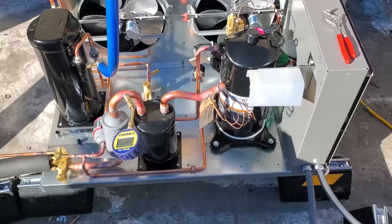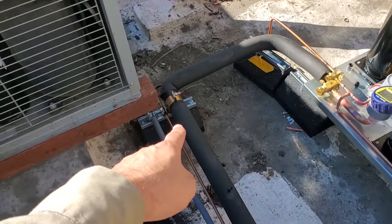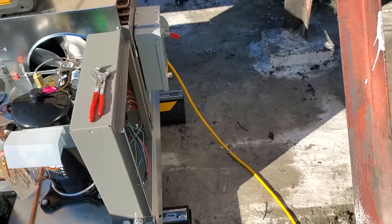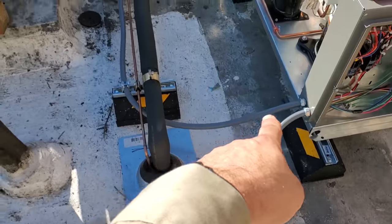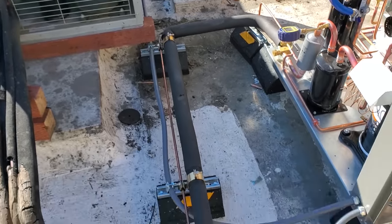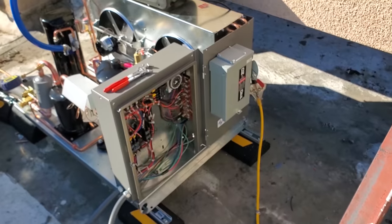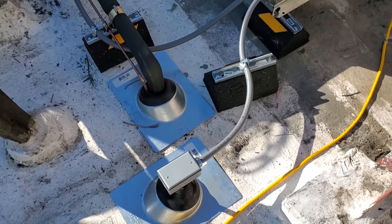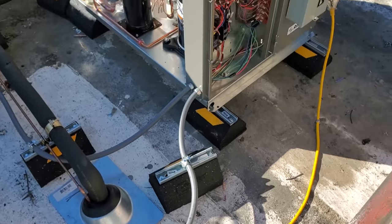We're just going to do some pickup work. Start taping up where the insulation's meeting, that kind of stuff. Put the fuses in. We're all wired electrically. We've got temporary power. This seal tight back here is temporary, and then when the electrician comes in, he can run permanent power into the disconnect switch. This right here is permanent. That's my evaporator coil voltage going into here.